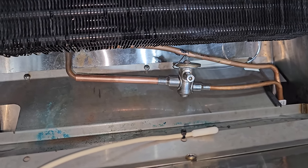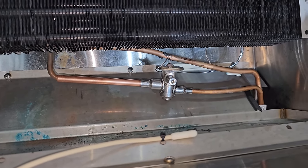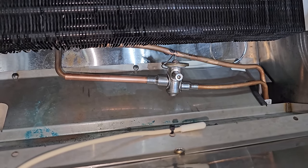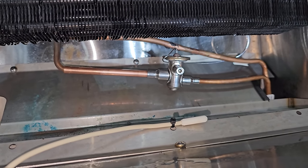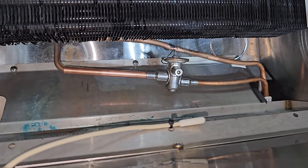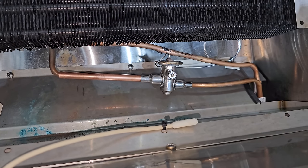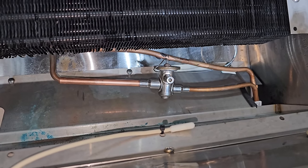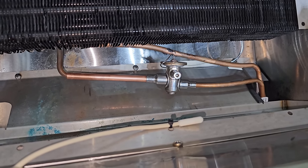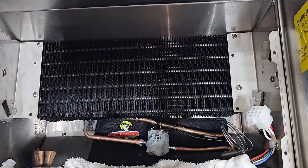I mean, the easiest thing is going to be to braze it with silver solder, but the problem with that is my other technicians might not know that it's silver solder when they go to change the TXV again. So you got to think, like, everybody knows that these things are 15%, but man, I'd hate to do this with 15%. Like, silver solder, I can guarantee we won't have any problems. Tricky, tricky. Decisions, decisions. So we are going to silver it. Fire going on.